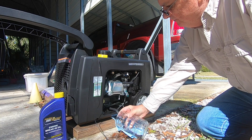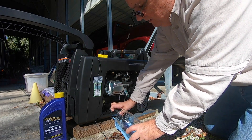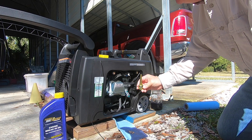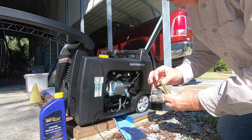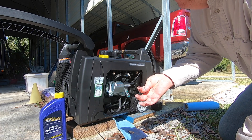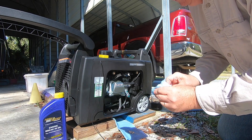I've got the generator set up on a slight angle, tilting it toward the jar to see how much of the oil we can get out. I've got the oil drained out and pulled the magnetic dipstick out to check it — it's pretty black on the end, and there's a good layer of magnetic material on there, very fine particles. I don't think that's unusual at this stage.